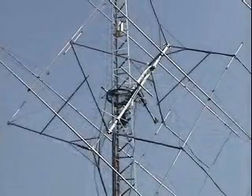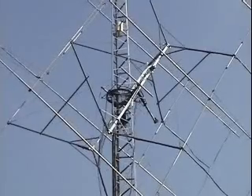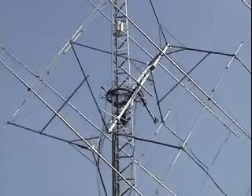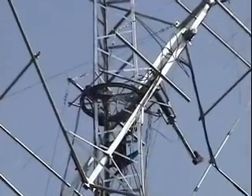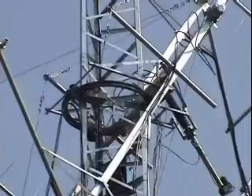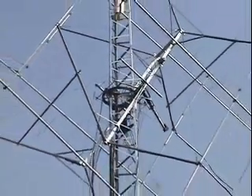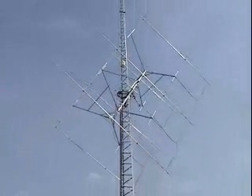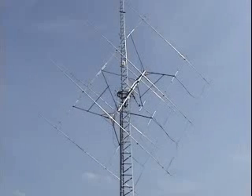What we have on the screen is the six Yagis. We're centered on the ring in the middle of the array — that's called a TIC rotor — and the antenna rotates on the outside of the tower around that ring. There are two motors on the ring that actually turn the array. The array weighs about 650 pounds, each antenna is 37 and a half feet long, they're separated by 16 feet, there's three antennas high, two antennas wide, and we're elevated to about 20 degrees elevation.